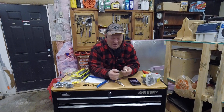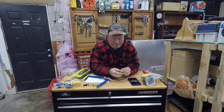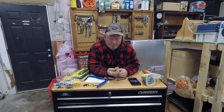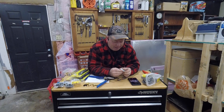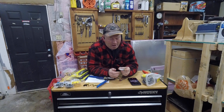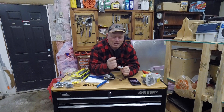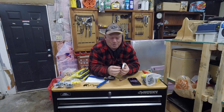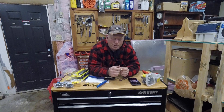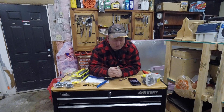I tried for a little while using a pair of pliers and a screwdriver to pry this off like they say you can, but I was unsuccessful. It's a really tough ring — but it has to be for your plumbing, right? It just proves that it's good because I couldn't get it off. What I normally do is use a Dremel with a cutting blade, take the thinner edge of the ring, cut it off — don't go too deep — and it doesn't affect the fitting at all. That's normally what I do, and it's easy since I already have a Dremel.